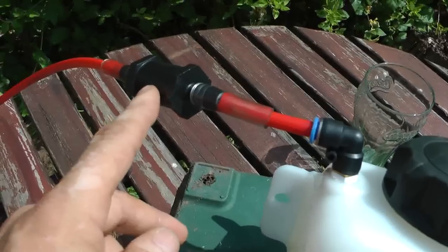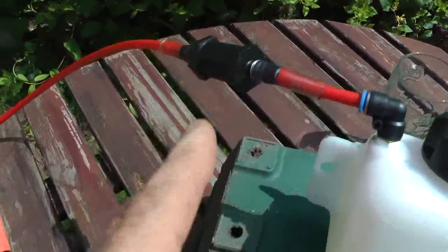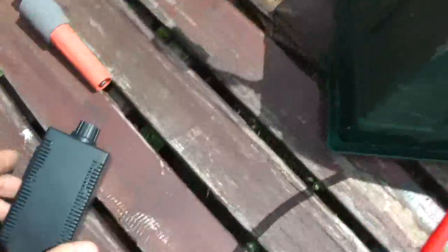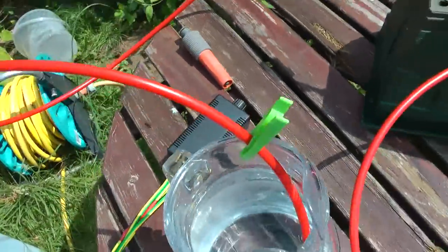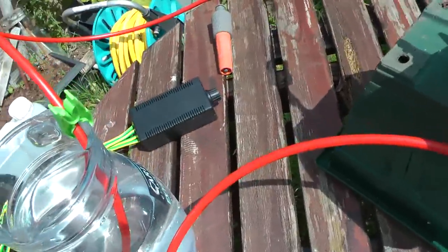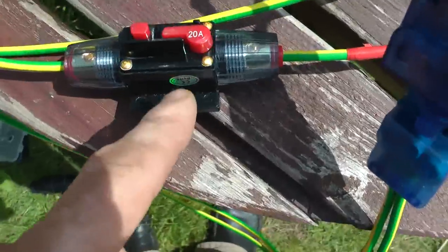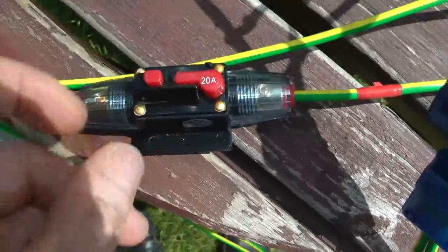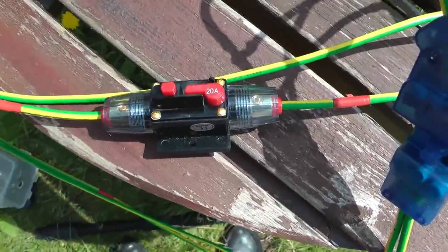Which is not the right size — I've got a problem with the right size one that was sent, I've got to do a video on it. Just another bubbler here to actually prove how it would work. The brains of the operation here — the pulse width modulator with frequency control. You can set it to four different frequencies, and we've got an automatic switcher to cut off the electric if it goes over 20 amps, like a circuit breaker, so we don't draw too many amps.